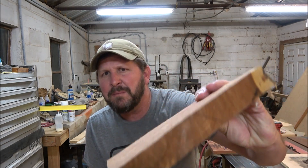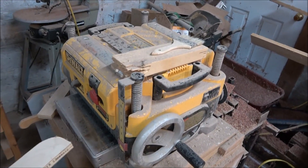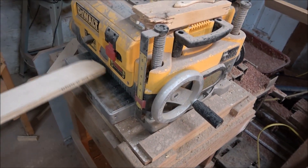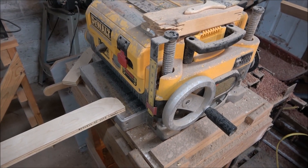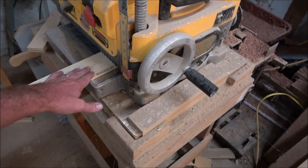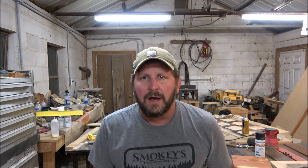The next question: I'll occasionally mention running wood through the planer to get it leveled out, and someone's asking what I mean. I've got a 13-inch thickness planer — it's a DeWalt, that yellow thing back over my left shoulder. This is rough-cut cedar from a mill; you can see it has a lot of rough surface. I can lower the handle to lower some blades — 13 inches long — and feed the wood in. It pulls it through and takes off a fine layer. Sometimes I run it through three, four, or five times to get the smoothness I want.